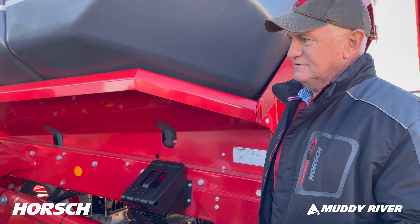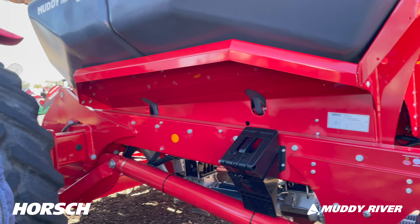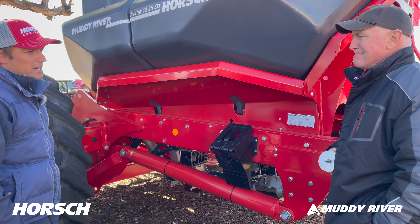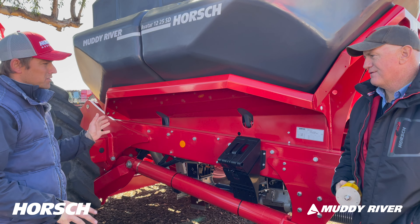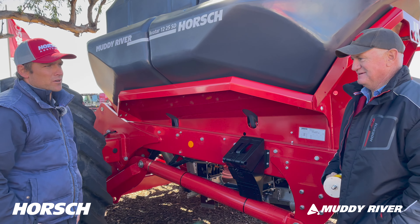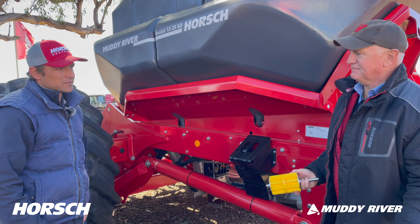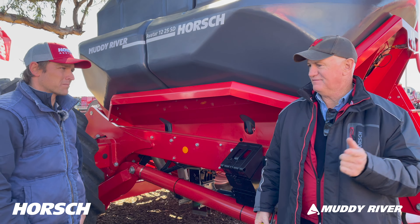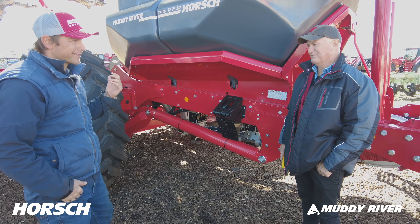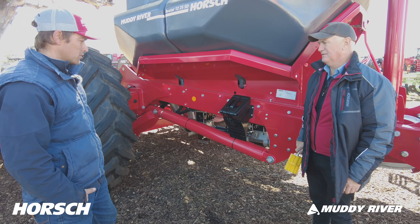Isobus — you can use it as an Isobus machine or it's got its own screen, which is a pretty good feature. In the cab we use two remotes: one's straight up and down, one's fan. You'd think with all the different functions you'd need five remotes, but no — it works very well through the screen. You've got one hydraulic line in and out for lift and raise, and you hit the button to fold. It's very safe for folding up — you can't twist the machine into a knot by accidentally using the wrong remote. It steps you through on the screen.